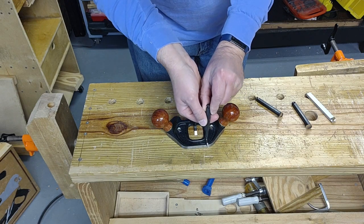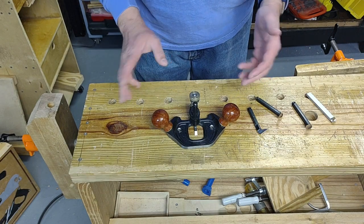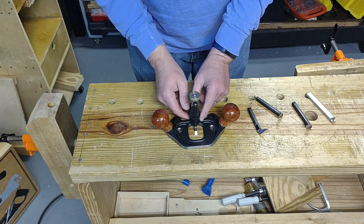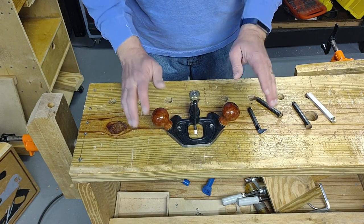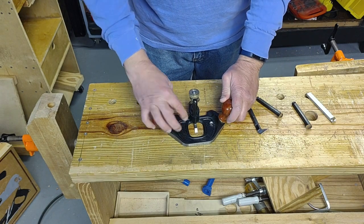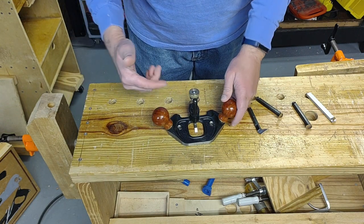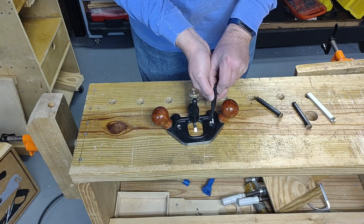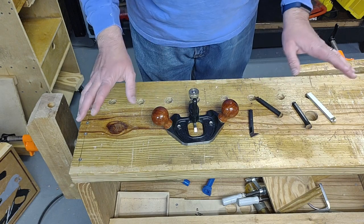Here is the eighth-inch blade. The reason I got these is I had a smaller router plane — a cheap, non-brand-name one — and the blade kept slipping. I couldn't keep it in place, so I tried using cork and that sort of thing. I thought, why not just get a quarter-inch blade for this one that works very well. For a lot of the puzzle boxes and small cabinets that I make, I do a lot of quarter-inch slides, quarter-inch dados, grooves, things like that. Same with the eighth-inch — sometimes I need a really small blade for eighth-inch wood. Those work very well and you can get other sizes too.